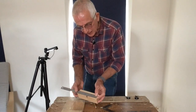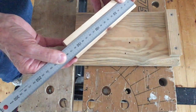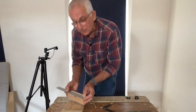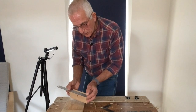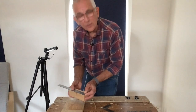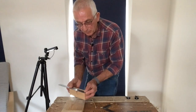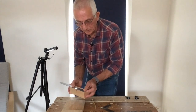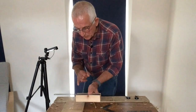What we'll do first is flush up the steel rule with the end of the piece of material. Your sense of touch is really sensitive — you'll be able to feel considerably less than 0.1 of a millimetre; I reckon it goes down to about 0.01 of a millimetre. Your sense of touch is much better than your eyesight.